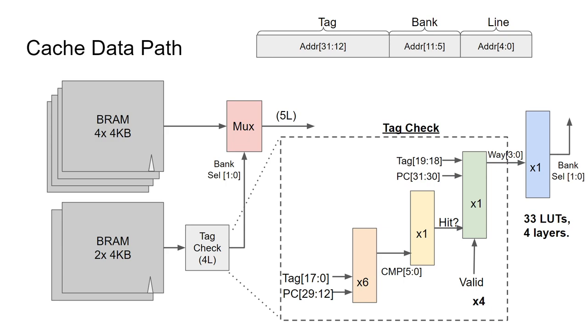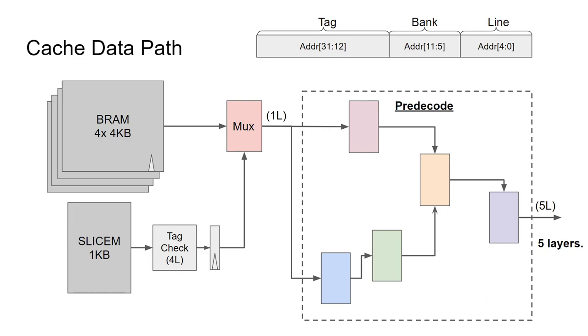Then also adding three or four extra levels for prefix decoding is probably asking for too much if a relatively high clock speed is desired. Although we can see that the cache tags are quite wasteful, given that you only need 128 rows but a BRAM has 512, and on top of that you would need two BRAMs to cover the four cache tags. An alternative approach would be to use the distributed RAM. In this case, the cache tag check can actually be performed in the previous cycle, since the distributed RAMs do not have a one-cycle delay. That reduces the bank multiplexer output to one LUT, and thus the propagation delay with the full offset decoding would be five LUTs, which is still reasonable to achieve decent performance.